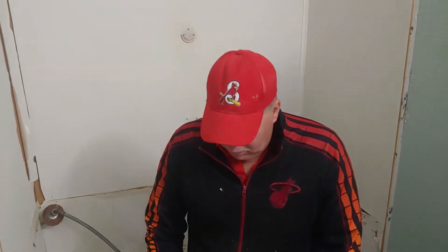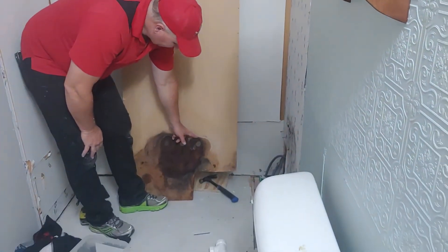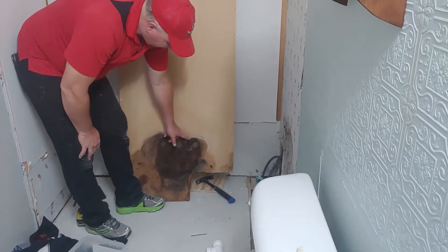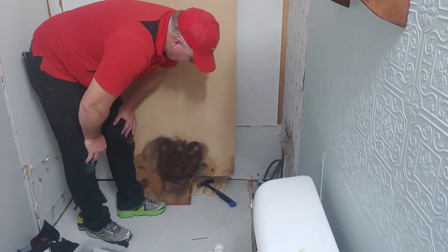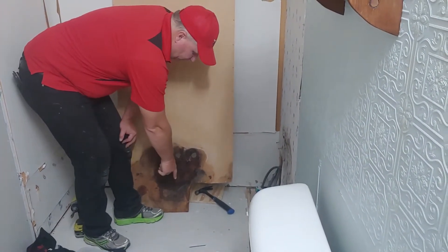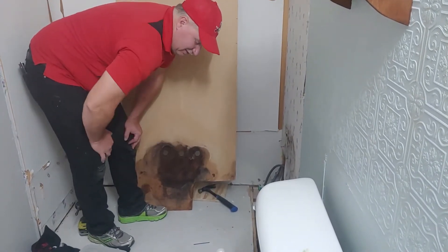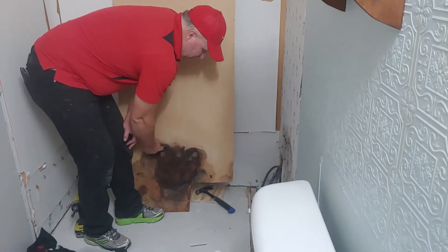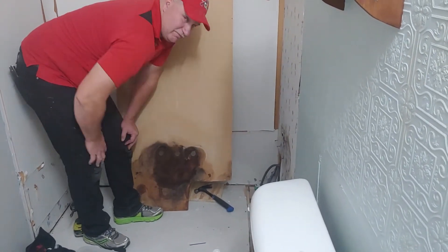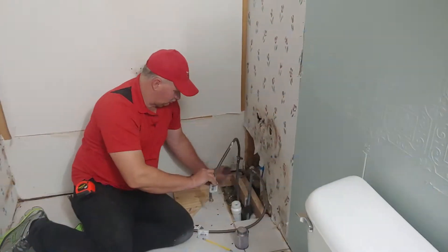Unless the customer's on a budget, I don't put these back in — I go to something better with a new tub surround. That's what we're doing here. We're actually putting in a cast iron tub, so we're taking this stuff off. I wanted to show you — you need to seal across the top of your mobile home faucet. If you don't, it goes down the back side and rots the area out, which you won't notice. Worse, it will rot the floor — the particle board gives out and then your tub will crack.